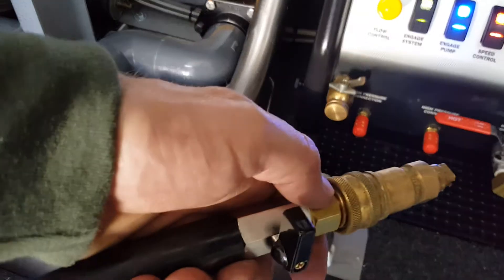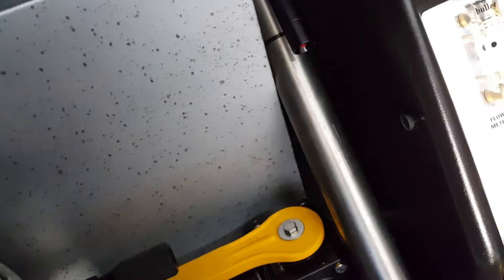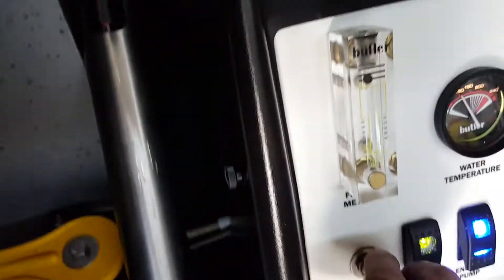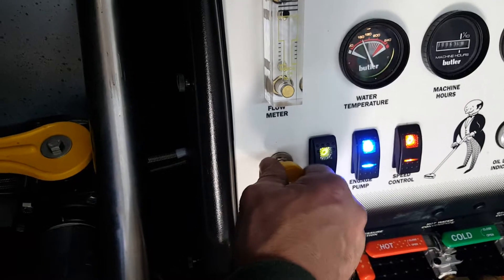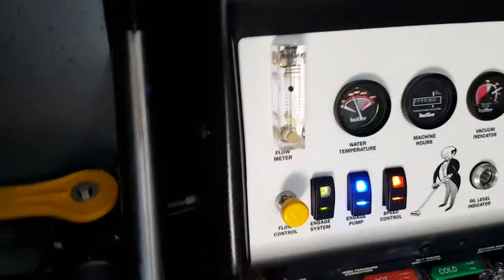8-0-0-5 jet on top — so here we go, let's just blow it into here. You can adjust from here — want more, you back it up, see it rise. If you want less, you tighten it up. Don't tighten it a lot, don't bottom it out. There we go — we're in the proper area.